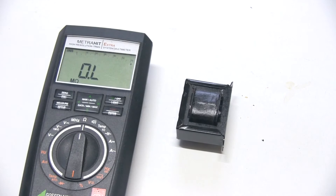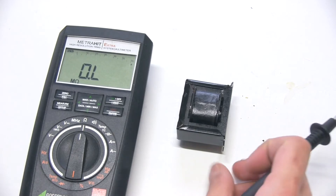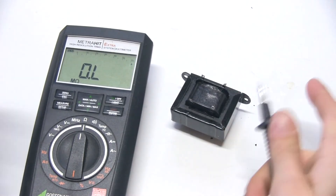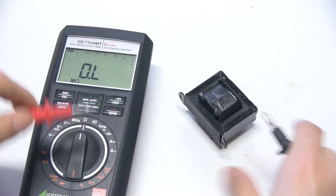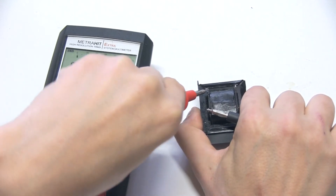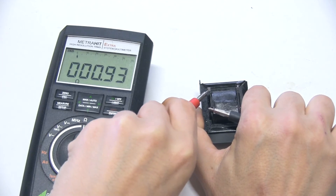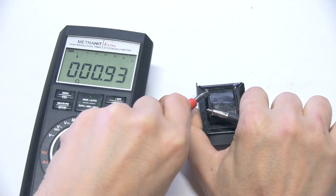The tools you'll need are pretty basic — just a multimeter, even a basic one will do a fine job. What we're going to do is measure the DC resistance of both windings. The secondary winding is usually close to zero, close to continuity. Measuring here we get 0.93 ohms — let's say 1 ohm. That means it is thicker wire, so it's the secondary — the speaker side.